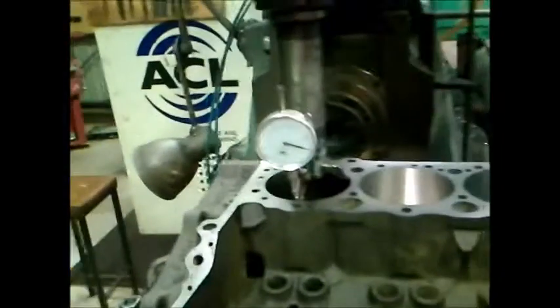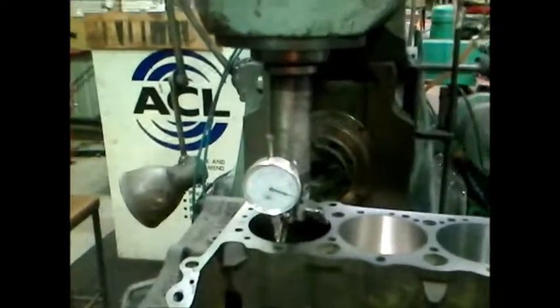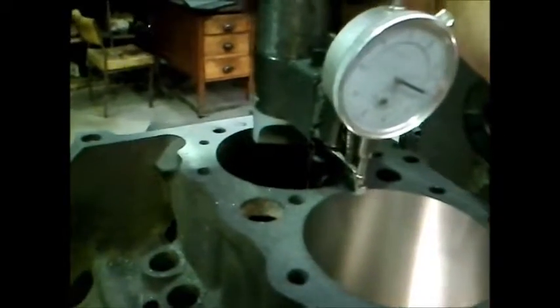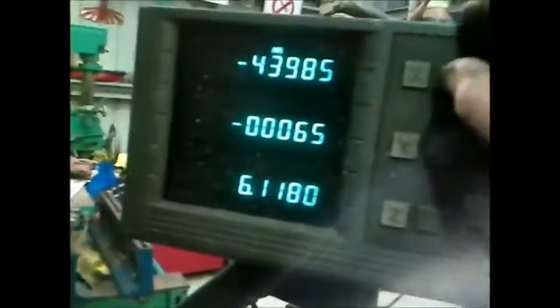How I centre the machine: there are a lot of boring machines around that use an air float head or what's called cat's paws to centre the bar. But what I use is simply an indicator, and you just check it on your four points — two points on the Y axis, two points on the X axis — and centre it. Bring it around and make sure you centre all the way around. Once we're happy that the indicator is reading true so that we know the spindle's in the centre of the bore, we can centre it.